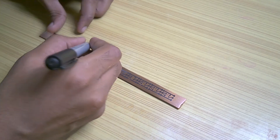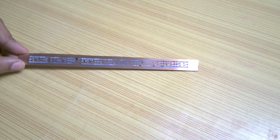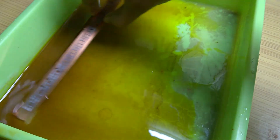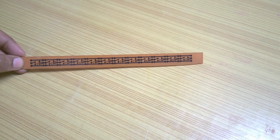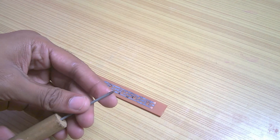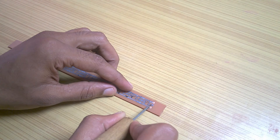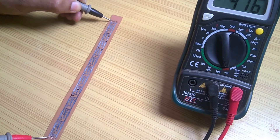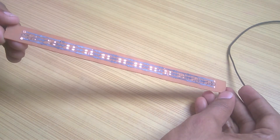Check for places where toner is not transferred and cover it with black marker two or three times. Then dip it in the ferric chloride solution — please be cautious and use gloves if you don't have much experience. I left the board in the acid for 5–7 minutes to completely remove the unwanted copper. Then using a sharp object I carefully removed the toner only from the places I had to put solder on, which removes the need for masking the PCB. Using a multimeter I checked for shorts and continuity — the board is really looking nice after all the processes.